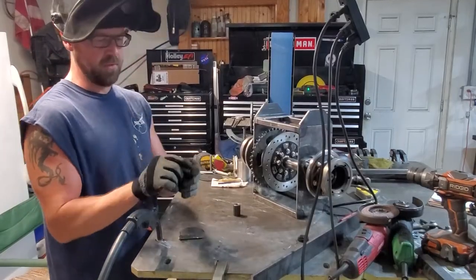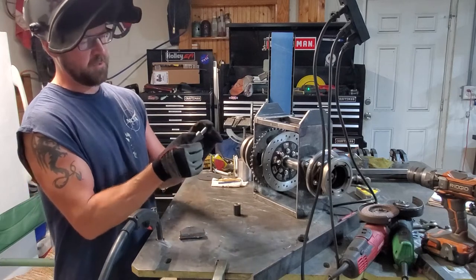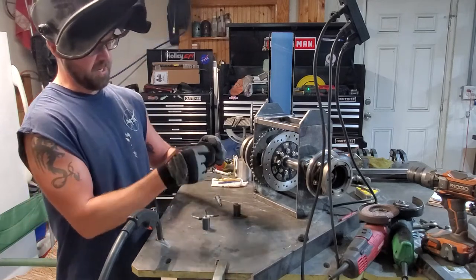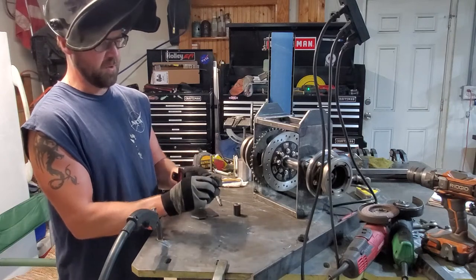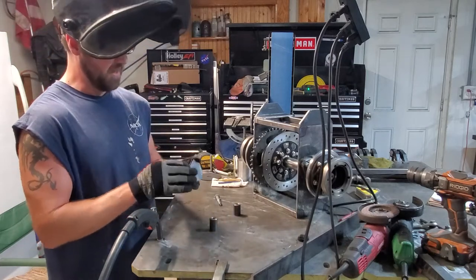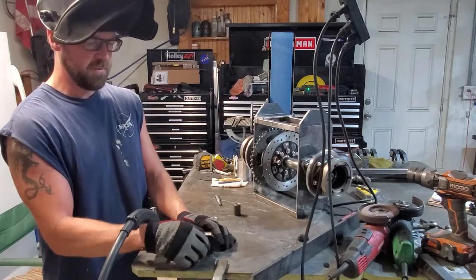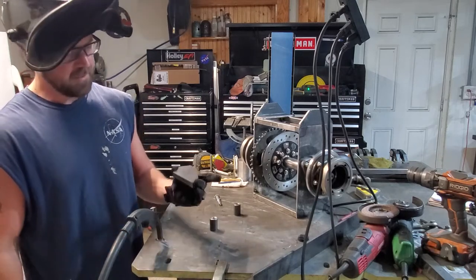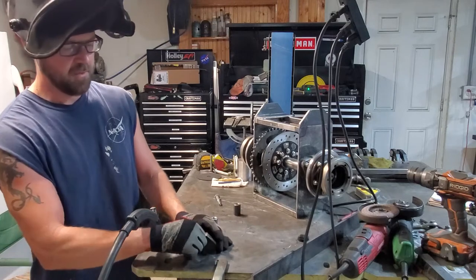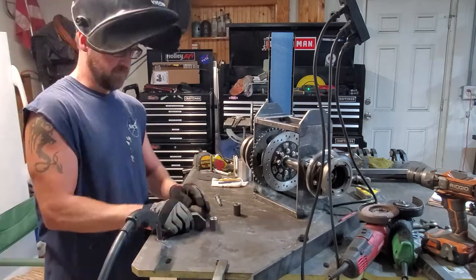All right. So we got a couple nice bushings — nice tight tolerance, almost no play at all, which is what I wanted. I want this to sit firm. These are going to be drilled out. I'm going to weld this into these brackets sticking out through the outside. So I made all these brackets and I cut them out with my angle grinder. I know that they are not exactly the same height because I cut them out with my angle grinder, and I want all my holes to be in exactly the same spot. So there's a little trick I learned — if you just take and weld these together with a couple little tacks, you can then drill through all of them in the same spot. And then while it's still tacked together, you can actually sand down all the uneven spots. That's what we're going to do.